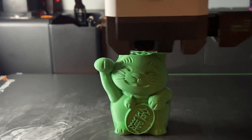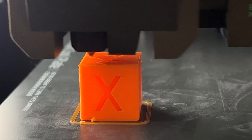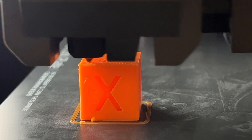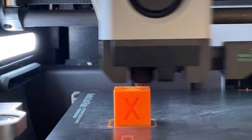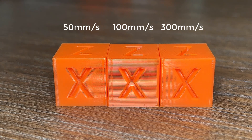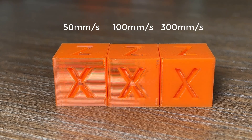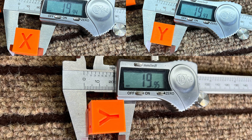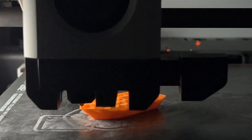I will start with some test prints with different materials and work with the AMS, or Automatic Material System. Many people wonder how different speeds would affect accuracy and print quality, so I will print a calibration cube at 50mm per second, 100mm per second, and 300mm per second. As you can see, the cubes are not very different under normal light. I will move the light around to make the ringing and ghosting more visible. As the speed goes up, it will still create some level of ringing, but the accuracy of the print is almost the same. I will then print some benchies at the same 50, 100, and 300mm per second.